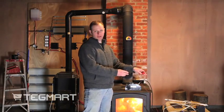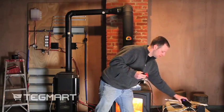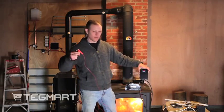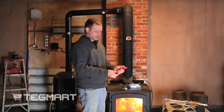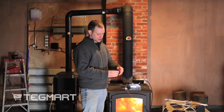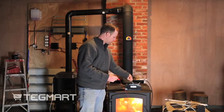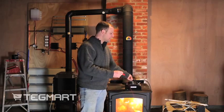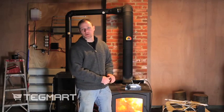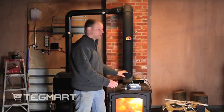A little further explanation of how the diversion circuit works — here's a diversion circuit right here, so there's no smoke and mirrors with this thing. I can take these two outputs and short them directly together, and if you look at the generator, the fan is still spinning. Now, if we didn't have the diversion circuit and you were to short the two outputs together, the fan would die immediately and you'd damage your unit.